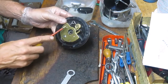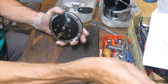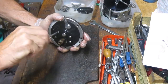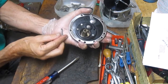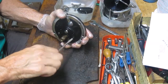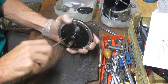We're going to take the bridge off — it's held by four screws. Just like the side plate screws, these four screws are different. The ones up top are partially threaded because springs ride on them; the ones below are fully threaded. Make sure you don't reverse them when you reassemble. If you put the fully threaded screws up top you run the risk of the spring catching on the threading, which will impede the performance of the spring or may cause it to break.